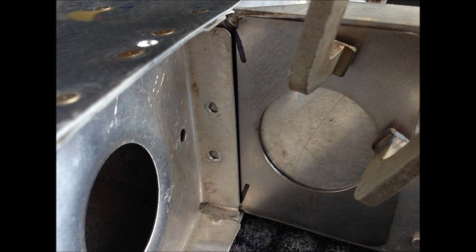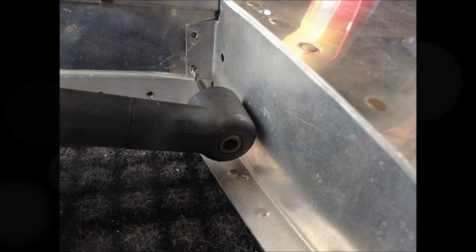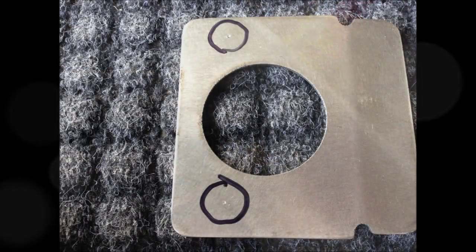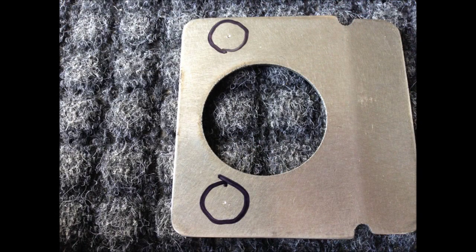Once you've clamped it in place, take a drill and mark a couple of opposing holes — one at the top and maybe one at the bottom. Don't try to drill this with the part in place because it's extremely hard material. Most air drills are far too fast — this needs to be drilled with a drill bit going slow, somewhere in the couple-hundred RPM range. Then reach through and spot the holes so you can see them on the stainless.